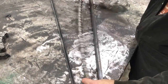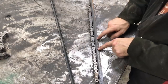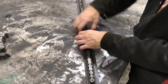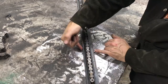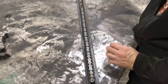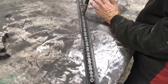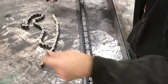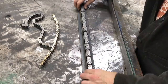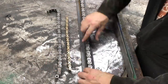If you want to get this chain nice and straight, you have a couple of different options: angle, some flat bar, square tubing. You're going to compress that piece together. You can either tack weld the angle to your work table, or just clamp it. Then you weld every little link down through here. This simple method works for all different thicknesses of chain — bicycle chain, motorcycle chain, tow motor chain.